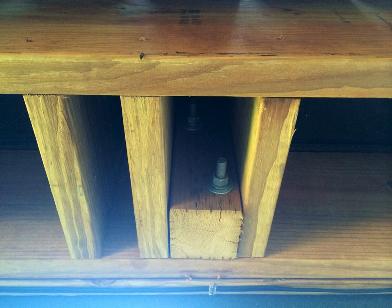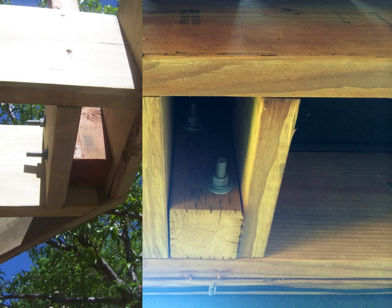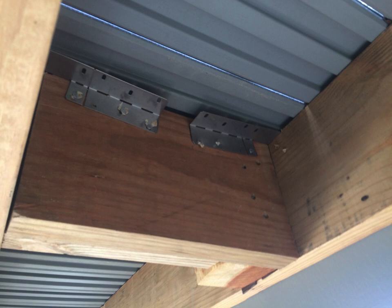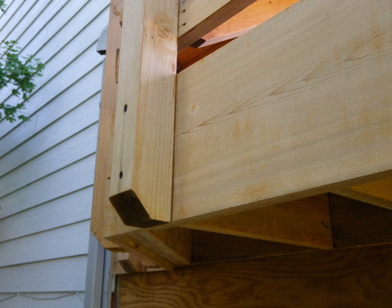This one has blocking down the whole edge — lots of blocks — probably there to support a picture-frame design in the framing. But have we satisfied the end-grain fastener requirement? Here we've got bolts — a stout connection all the way through the 4x4 — but these bolts only connect that 4x4 to one member, and beyond that, we've got to get the load path to the other joists. Is that just nails in end grain? A similar one — but notice the difference: the bolt catches the block and now ties the bolting with the block to the joists. This other design isn't using typical hold-downs; the block provides compression at the bottom, two brackets wrap around the outside — no fasteners in end grain. This looks rather stout. Now this one mounted on the outside drastically changes the load distribution because you're no longer utilizing the outer rim board to spread the load, and it's installed with very narrow-head timber screws with very little surface area to stop the post from pulling through.